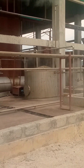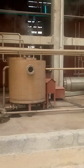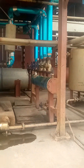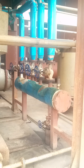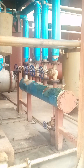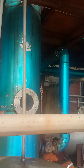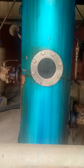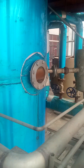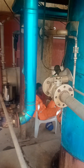On the other side we have the beer wash tank and spent wash tank. The other side is the spent wash tank — that is vinasse. Here are the siphon legs, and here is the steam header. It is a manually operated plant, so this is what we inject into our towers. These are the two towers — that is the rectification bottom, and this is the stripping or analyzer column.